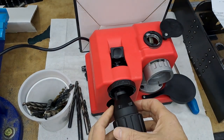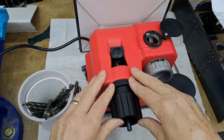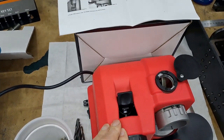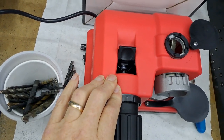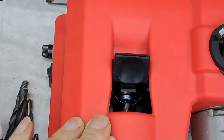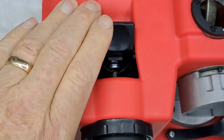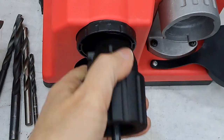This then has to go into here. These two prongs — there's a gap in the ring over here, they line up — there we go. That goes in as far as it will. Push on the drill and you push the button — that moves forward. You can now see those two little sprung steel levers now clamping the drill literally by the flutes down the sides. Once you get it there, tighten that up and pull it out.